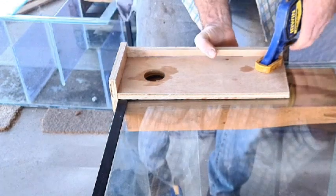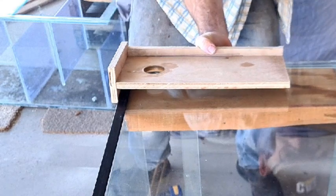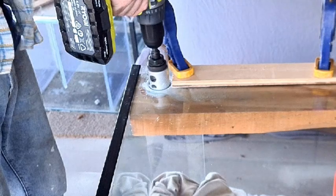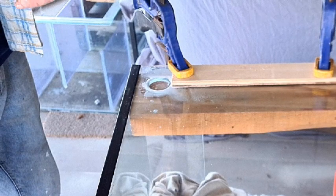The saw isn't really cutting, it's more grinding, producing fine powder. Just go nice and steady, don't be in a rush — let the cutting edge do its work and keep adding that water to keep everything cool. When the hole is almost all the way through, I personally like to remove the jig so I can see that the hole is going evenly all the way around, straight through, so it won't leave any big chips. And there we go — done. How easy was that?